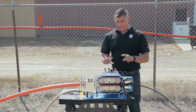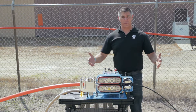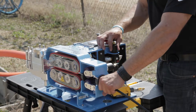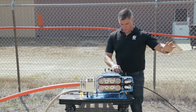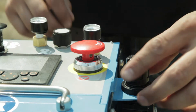The goal of crash testing is either to fold the fiber or to get the pressure high enough that you know the machine can't fold it. You'll use maybe four to six feet of scrap fiber doing this, but you'll know that when you go to install that two, three, or four thousand foot run, the fiber won't fold on you. Increasing to about 6 PSI and speeding up — letting it go — nothing. At this range, it's really hard to fold the fiber, and it will install at a good speed without ever folding.